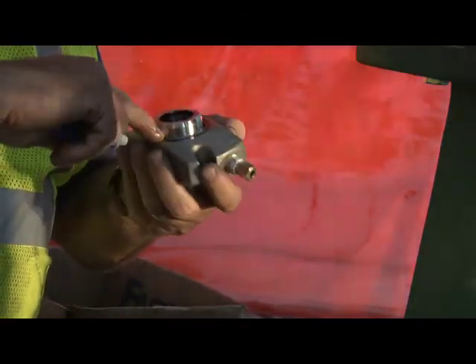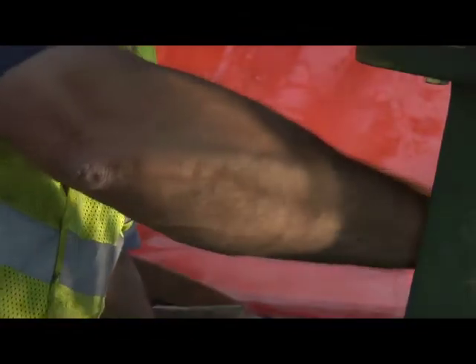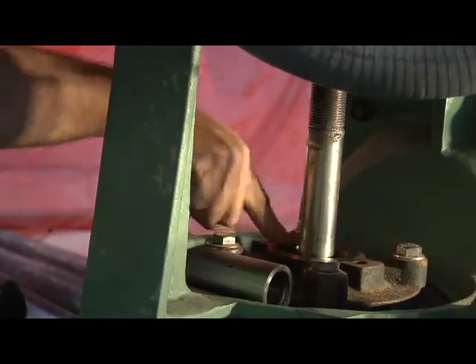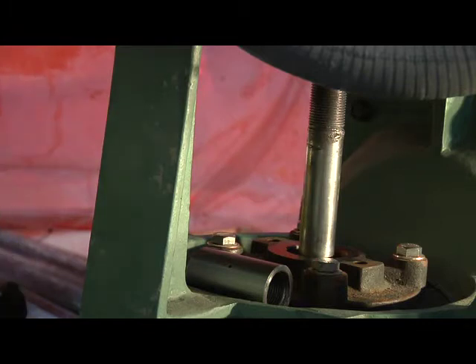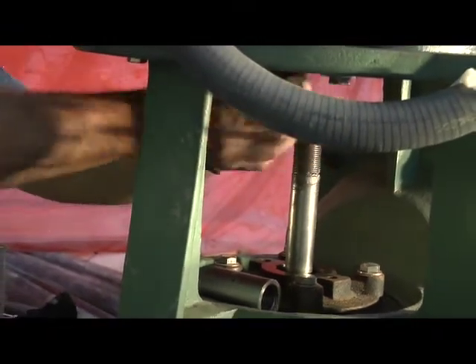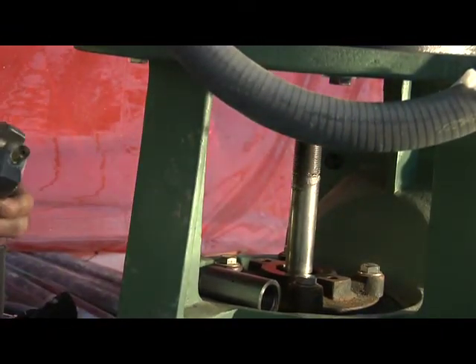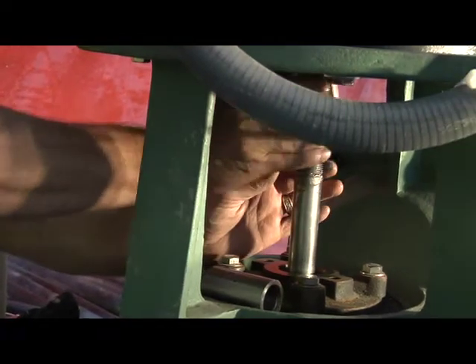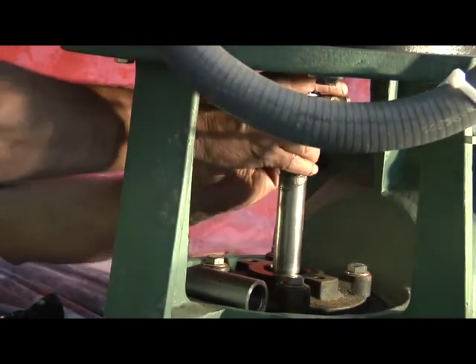Also put just a little grease where this O-ring seals on the top casting of the stuffing box, so you want to make sure this surface is good and clean. The trick here is to get that started. One thing you do want to check is make sure that none of the set screws are sticking through, as that's going to hinder the seal from sliding down.